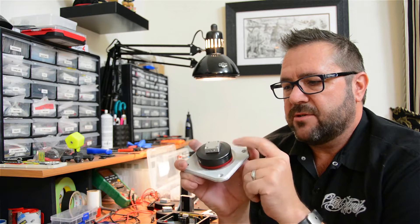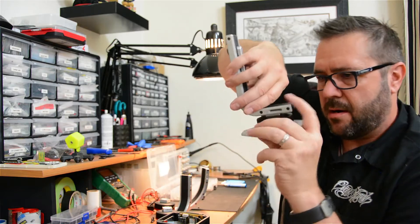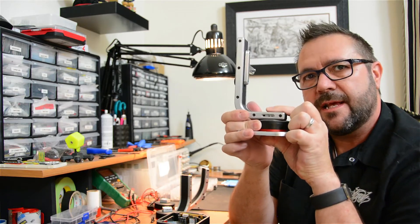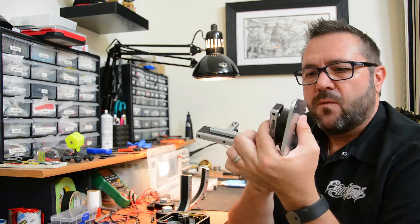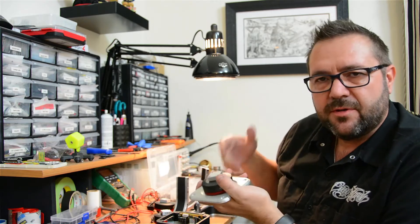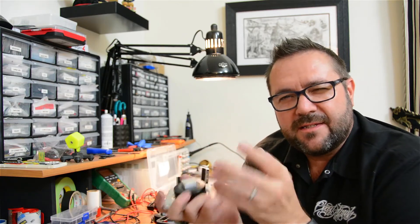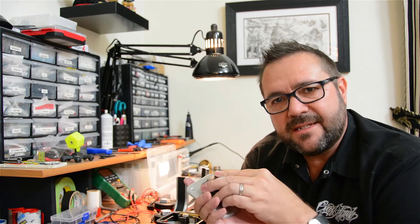I threaded all of the 3mm metric holes which have the adjustable slots. The thought is we'll mount this hub onto the motor and then mount the arm onto that hub. The hub will be bolted into the arm and allow it to slide — it has about an inch of travel, and each of the arms has the same mechanism in place. This allows you to adjust the center of gravity when you have a camera sitting in the gimbal. I've done all of the calculations and measurements in Fusion 360, using its physics capabilities to anticipate the correct center of gravity, but having the actual parts in your hand is no substitution. Let's get all of these motors and gimbal arms connected and fit test it.